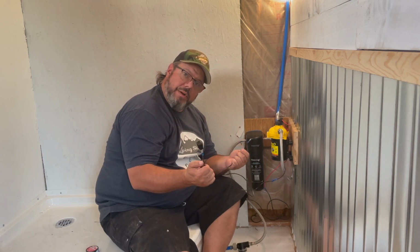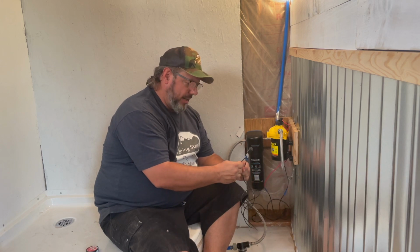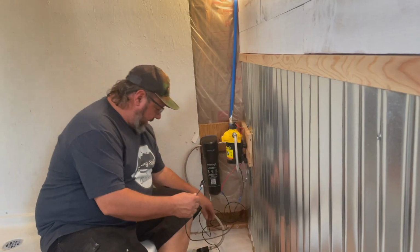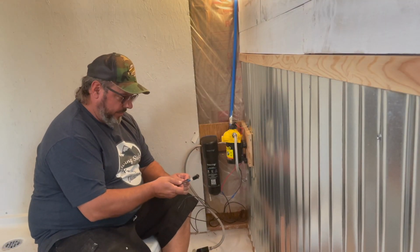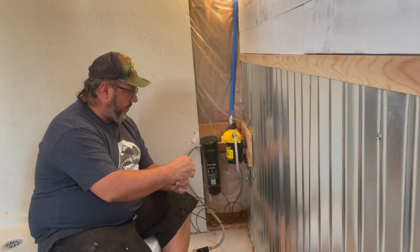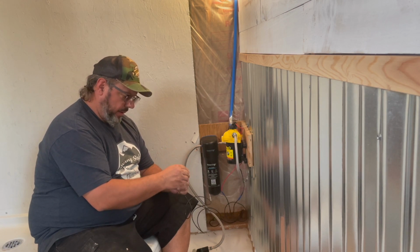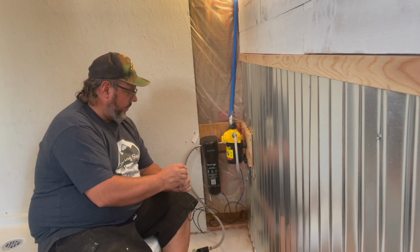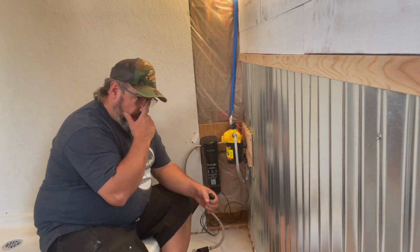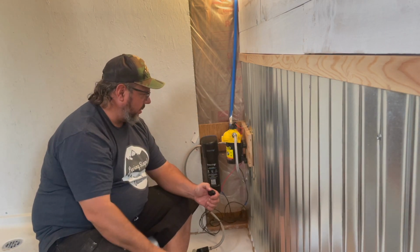Okay, I got both wires disconnected. I'm gonna go connect the battery, and then I'm gonna go try this. Play with the switch. Alright guys, I got my pump connected. That simple. On off. 12 volt system's pretty easy. Form a circuit, makes the pump go.